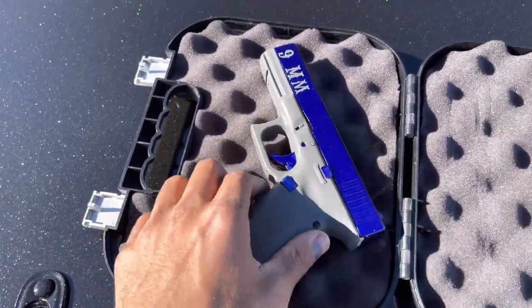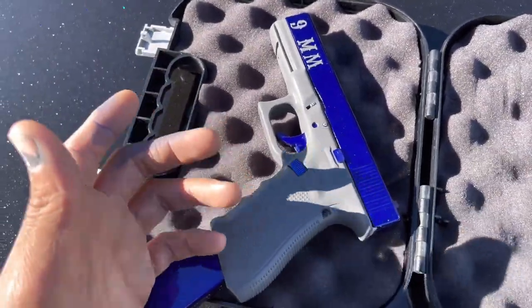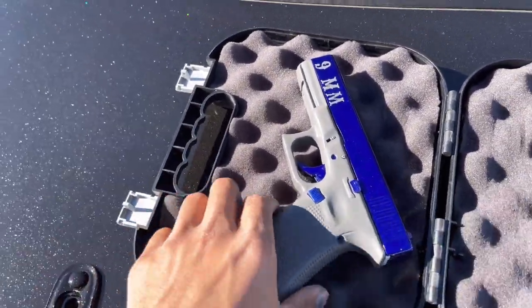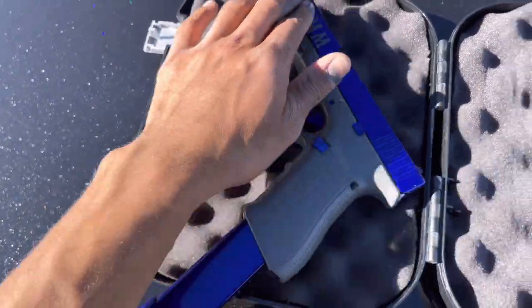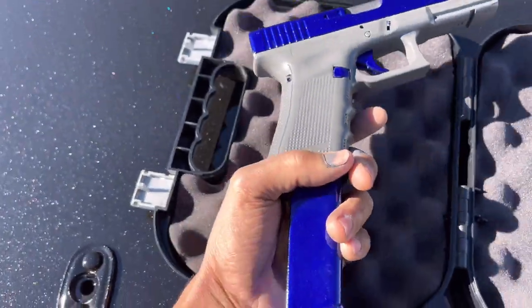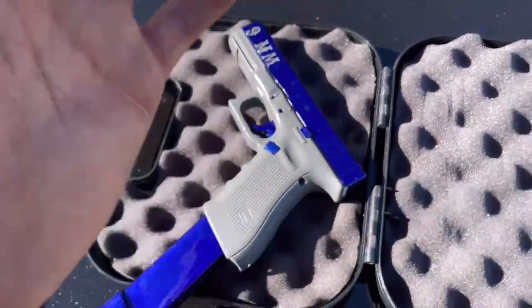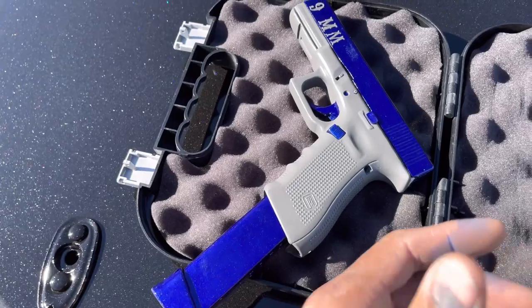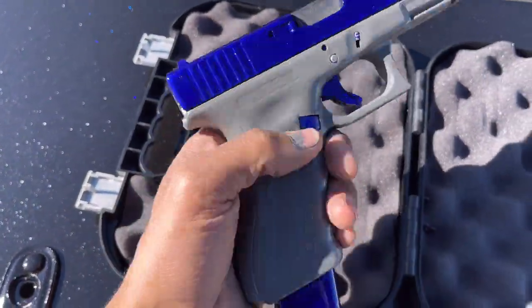It's not necessarily about the quality of the paint that you get. It's about the prep. I've seen people use some super cheap paint and it stuck better than expensive paint, just because of the way they prepped it. Prepping is the sanding process and the cleaning process before you paint it. So scuff everything up with some 180 grit sandpaper.